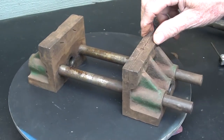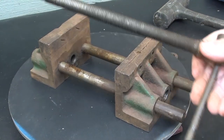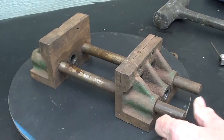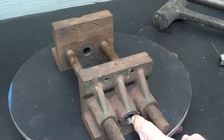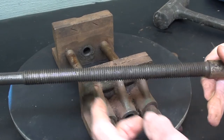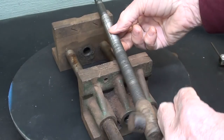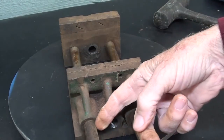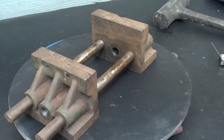So what is the fix? There are really two possibilities. When I originally bought this vise, I thought it was a perfect candidate for a left-hand thread — drill it out and put a bushing in there with a 5/8-11 left-hand thread, then cut a new screw with a left-hand thread, which would cause the vise to close when you turn it to the right. But then we're still stuck with the guide rods sticking out what amounts to, I think, the wrong end.